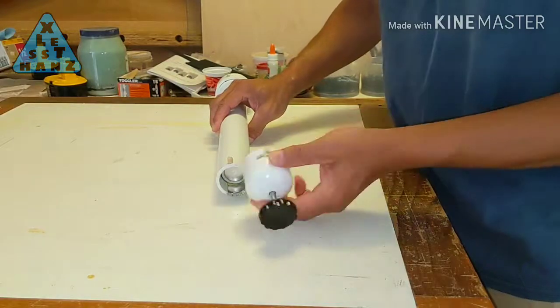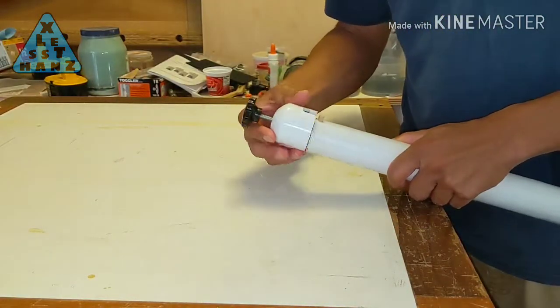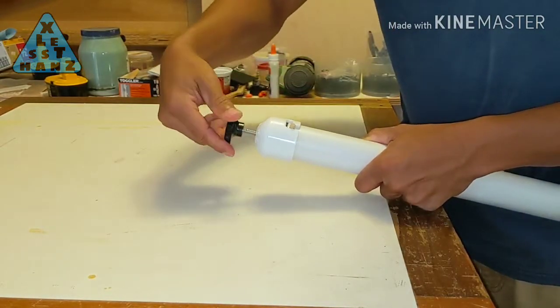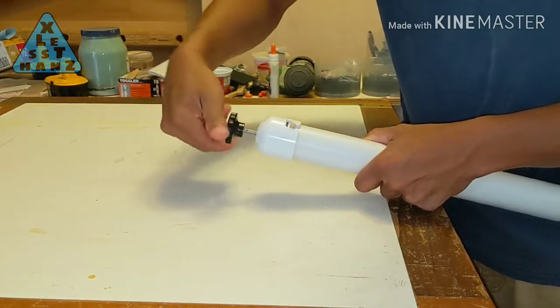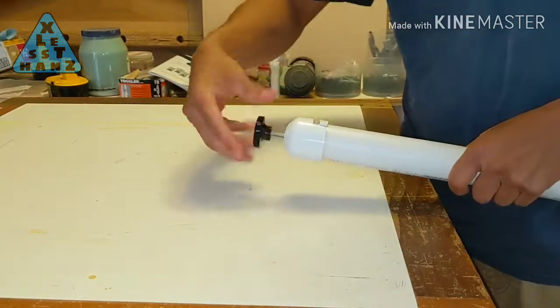Now you can see the reassembled switch with the new cap locking mechanism. Just line up the notch opening with the dowel, slide in, and turn. That should keep the cap in position when the on-off knob is overturned, especially when turning the flashlight on.